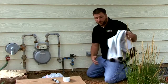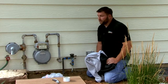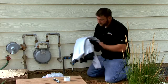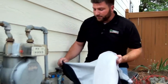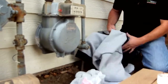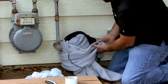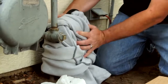For those who haven't had the opportunity to prepare — say it's late at night, you just found out there's a freeze warning in effect and the hardware store is closed — we recommend that you get an old sweatshirt or a towel, grab a flashlight, get out to your backflow, and wrap it tightly to provide a little extra insulation from the freezing temperatures.